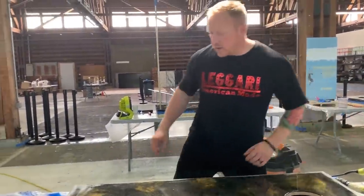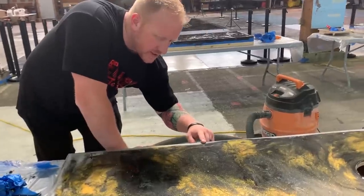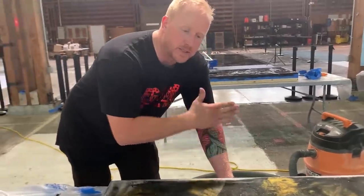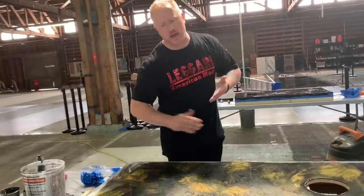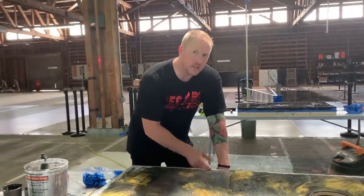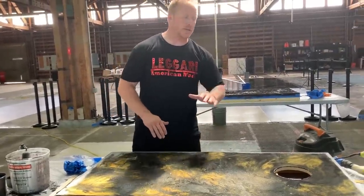So one thing you'll notice is I'm trying to really flatten the top. I'm sanding where I start to see it sanding onto the flat part of the surface. The reason why is because you don't want any lips — especially in a game like cornhole where part of the strategy is to knock your opponent's bag off. You want it to be able to actually slide off; you don't want it to catch on an edge. So I'm making it completely flat and then just hitting the side and barely rounding it to give it the correct profile.